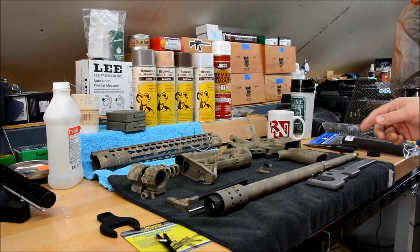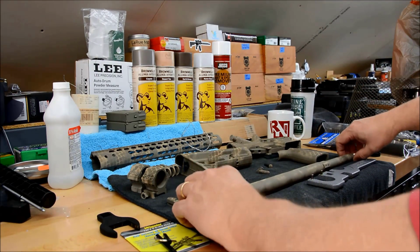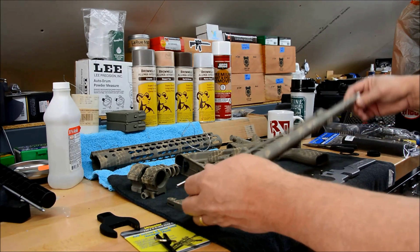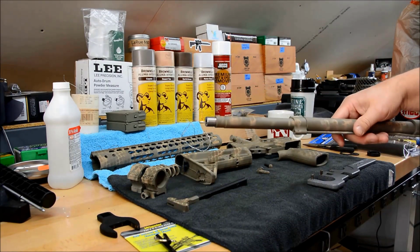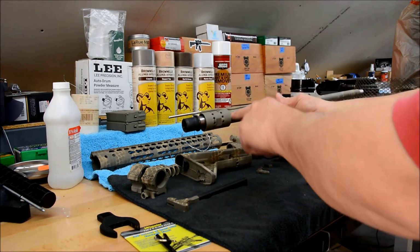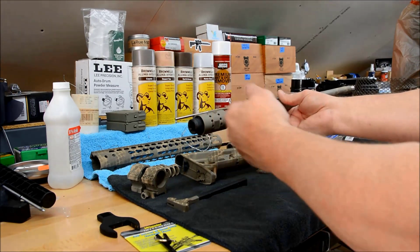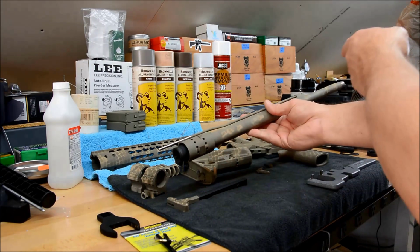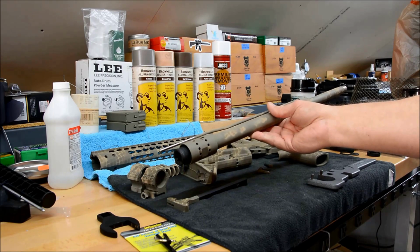The barrel was then assembled with the handguard in place onto the receiver, and so I had lightly threaded this, but here is where I made a major mistake. For those of you who have not done this kind of coating before, one big piece of advice is put your barrel nut on the barrel before you coat. I had done them separately and had everything just where I was really happy with the coating, and could not get the gas block off. The thickness of the coating was enough to stop this.